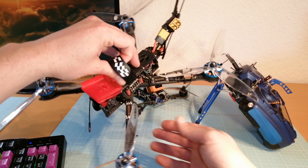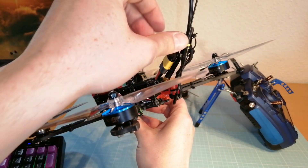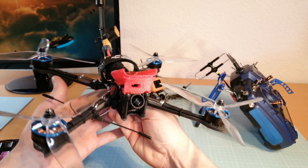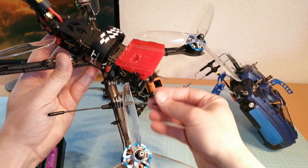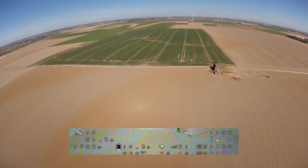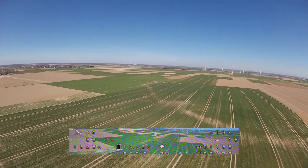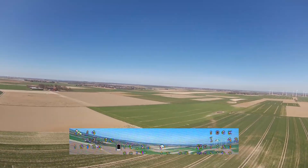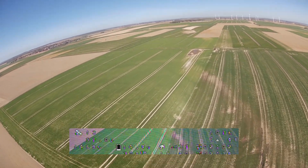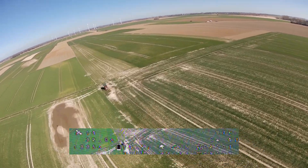That's why I'm using two receivers redundantly on my long range quad, with one vertical antenna at the back and one horizontal antenna at the front. So let's fly this quad home, and at the end I'm showing you both flights in a split screen so you can compare the RSSI values side by side. Thank you for watching — see you next time, and tell me your thoughts about my test results in the comments below.